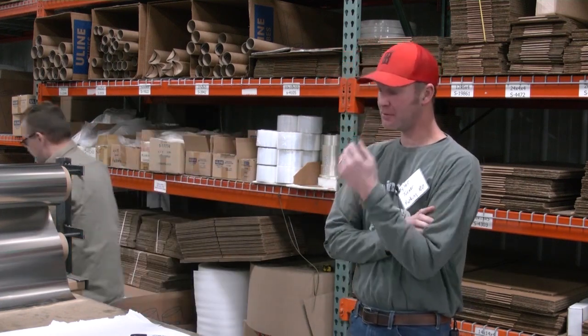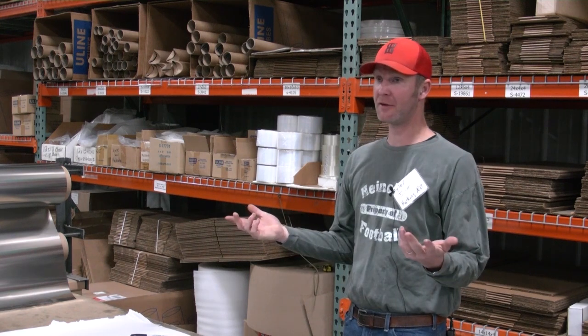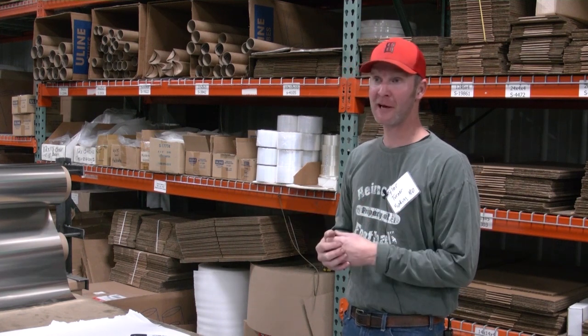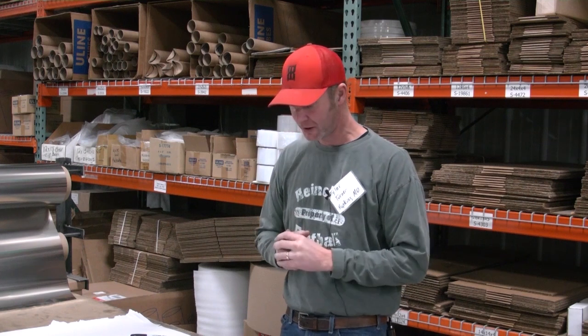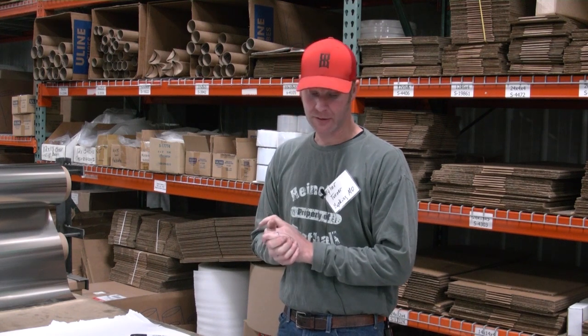And some guys run Nylatron washers or Teflon washers. Those things work great. You ain't going to wear them out. There are bench-made knives that are 30 years old and still have the same Teflon washers in them. It's just a mind thing. I guess you feel better about putting phosphor bronze in versus some kind of piece of plastic. But it's whatever you want to do. Is Teflon machinable? Yeah, absolutely. Some guys make their own washers. They won't even buy them. I buy mine. I don't have time to be making 20,000 washers.